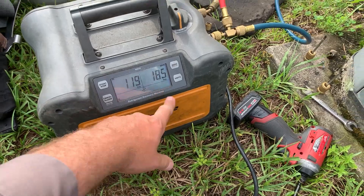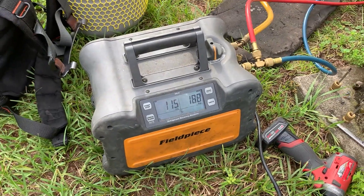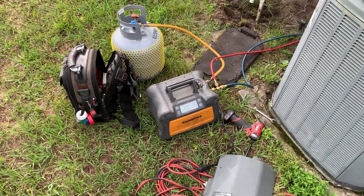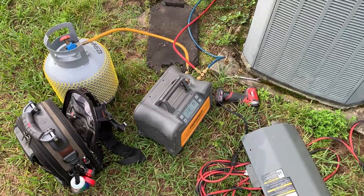This is R22 to the output on the tank side. As you can hear, it's not having a hard time with it, the recovery machine. What you want to do at first though is you want to let a decent amount of gas just flow through before you start up your recovery machine. That way you're not killing your compressor.